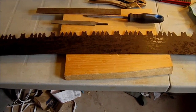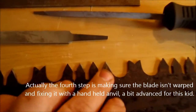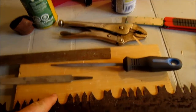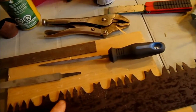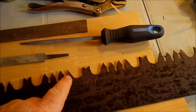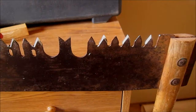There's three major parts to it. You have to sharpen, of course. You've got your blades here that need to be sharpened. You've got rakers that need to be adjusted. The rakers remove sawdust from your kerf. And then to adjust the size of the kerf, your blade has some offset. And you have to set that offset by actually moving the blades, one away from you and one towards you.